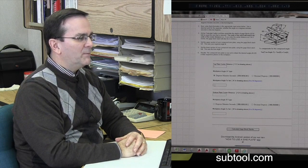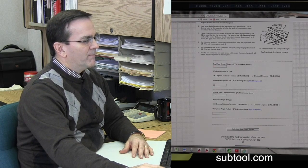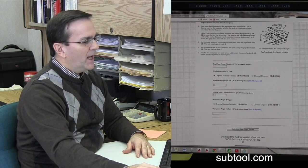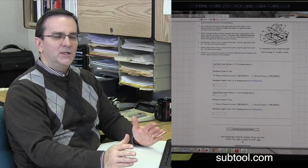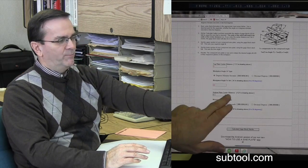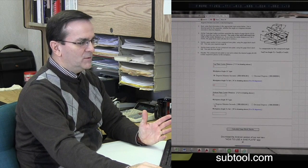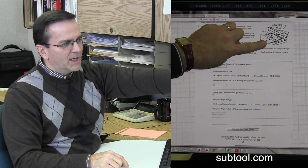Come down here to the workpiece angle to set. Let's say that our top angle is 22 degrees. Then we're going to input our bottom center plate distance, which again on the SPC-66 is five inches. And let's say that you know that your center distance isn't exactly five inches — maybe you've measured it and found that it's a little bit more or a little bit less. You can put in your exact distance if you need to be that accurate in your angle setting. Then again, choose decimal degrees or degrees, minutes, seconds, and you set your second angle.